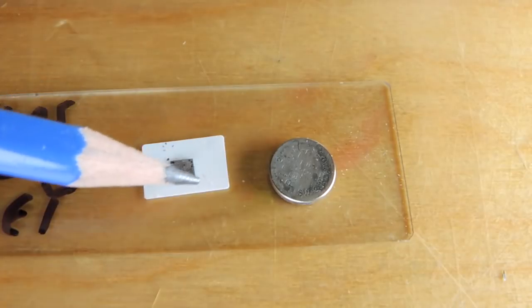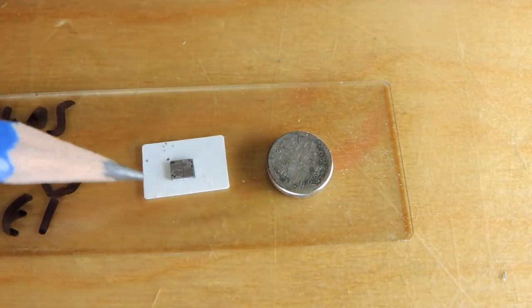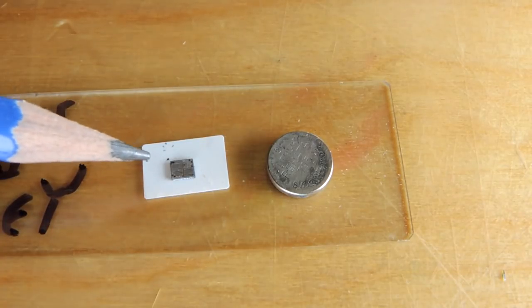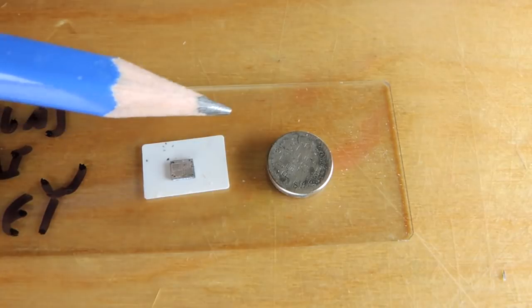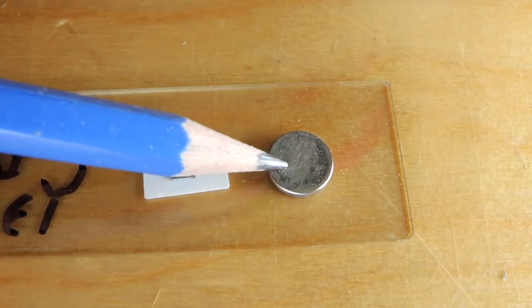Here's what was inside that package: an integrated circuit and a lithium battery. That's because this is a RAM-based design. 30 years ago, having an EEPROM to store non-volatile information — and then putting in the programming circuits, because the EEPROM cell requires about 20 volts to program — all lay far in the future. So the vendor had to use RAM and, of course, a battery.